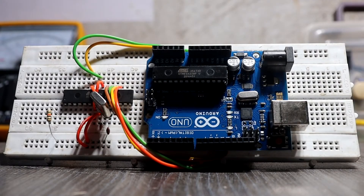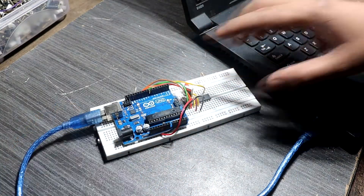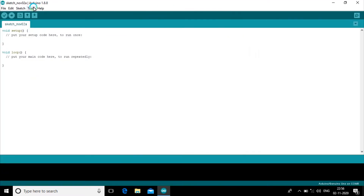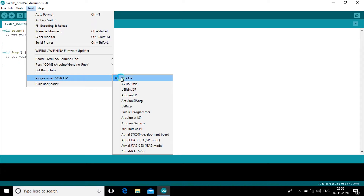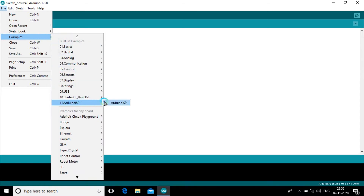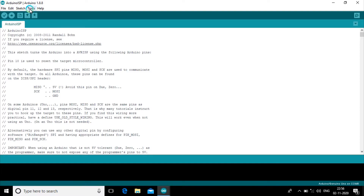The microcontroller bootloader typically occupies less than 1 kilobyte of memory. Once the ATmega328 microcontroller is ready with the bootloader, it's time to burn the new unprogrammed ATmega328 microcontroller. Connect the bootloader setup Arduino Uno to PC. Open your Arduino IDE, go to Tools and select the correct COM port — in my case COM port 8 is connected. Go to board type and select Arduino Uno. If you use another Arduino module like Nano, Mega, or others, please select the correct board type. Then go to Programmer option and select Arduino ISP. Now go to File, click Examples, and open the Arduino ISP example code. You have to upload this special program onto your working Arduino Uno. Then click the upload button.